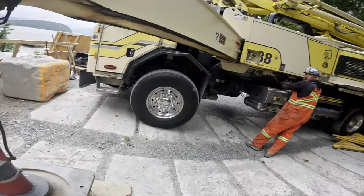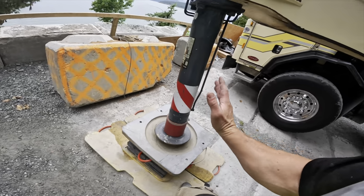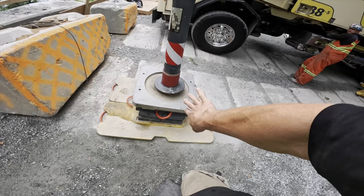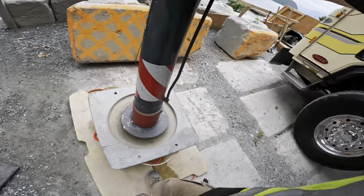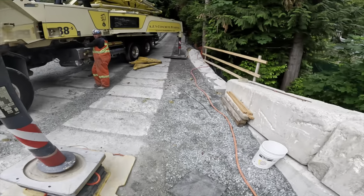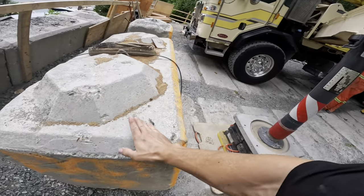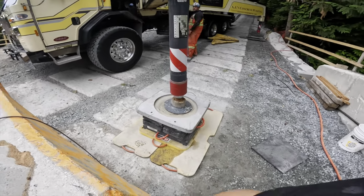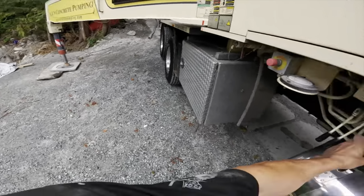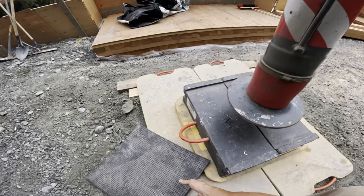Check. I always kick my stack ahead a bit because as the pump loads up, that pad's gonna slide ahead on the stack. So I start with the leg more rearwards on the stack. About like that. Drop this side down. Oh, nice. That's the kind of day it's gonna be. Get that one. We'll lift this back up. Put the grip pad down, we'll just jack it up first.